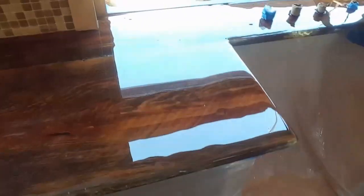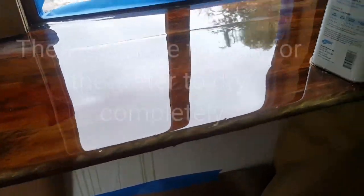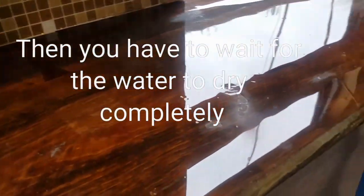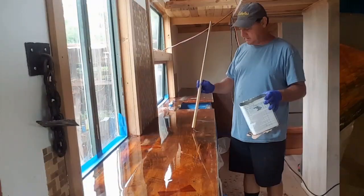I'm going to show you a couple of little spots here where I didn't get all the wax up — I'm going to have to sand those spots down, clean them with hot water again. That's what it looks like after I've sanded them and cleaned them. See where the wax came through when it fish-eyed.